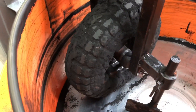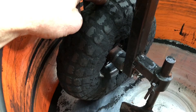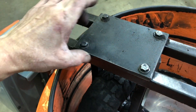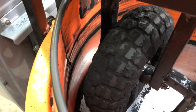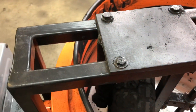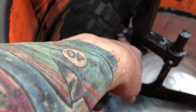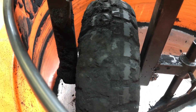Getting to the wheel — the wheel is, there again, just a box store wheel. Really simple. I think it was $9, maybe $12 — I don't know, it was cheap. Upper plate — I bolted it because I didn't know at the time what angle that wheel should be at. So I played around with it, turned it and adjusted it until I got it where I liked it, and that's where it worked best. It's almost running on the same angle as the outside of the mixer. Weld it up, get yourself a big bolt, and I put some washers in there to space it out. You're going to want to try to keep it pretty even between your mounting posts because this will get really filled up full of sand.